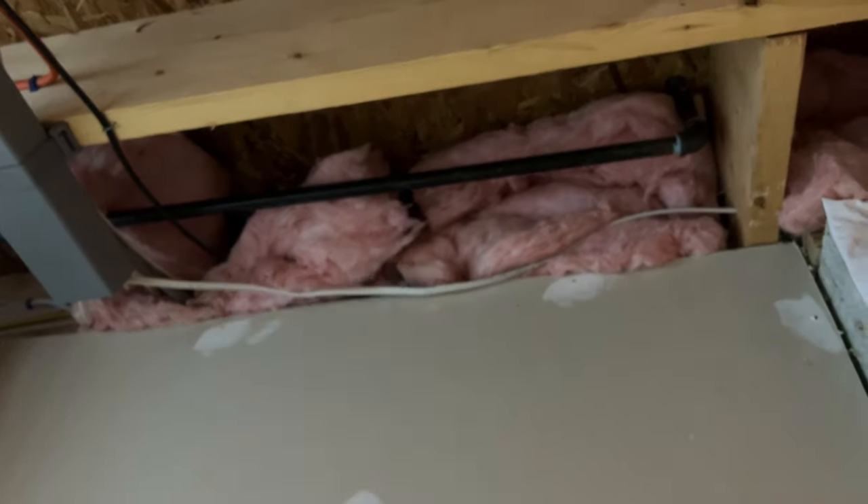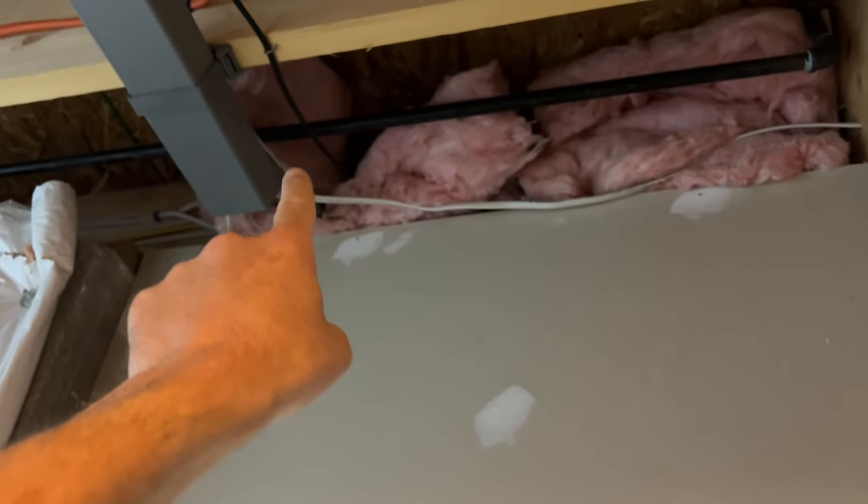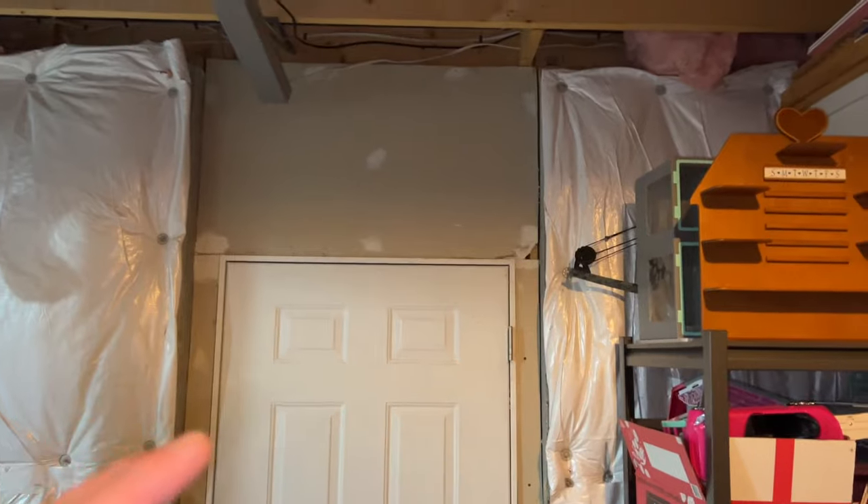Right there is the 220 line coming over and up into the electric oven. I'll probably be cutting that line somewhere in here, then putting my transfer switch mounted to the ceiling, and running my extension wire through the wall out towards the garage. The main reason I didn't want to run a dedicated outlet all the way from the fuse panel is the distance involved.